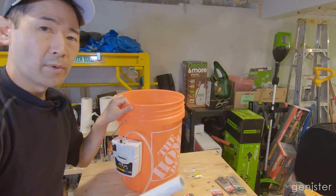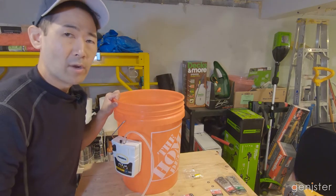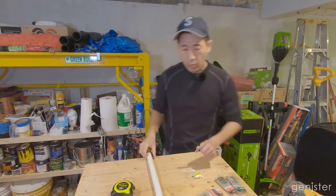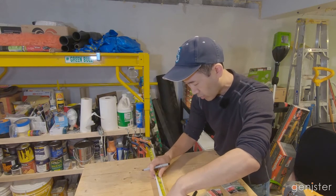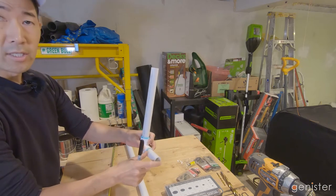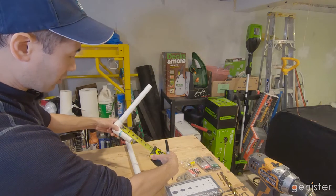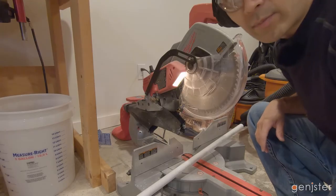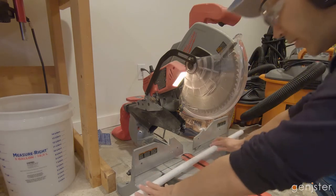I'm going to go ahead and cut this pipe. I'll use my miter saw — that's the best tool because it gives a really nice clean cut. If you don't have a miter saw, a hacksaw with a blade that can cut PVC will work well. I have three-quarter inch PVC pipe here, so I'll mark it off at 11 and three-quarter inches. For the extension from the bottom of the elbow, I want it to go out a few inches to hit the center of the bucket — probably around three to three and a quarter inches. I'll go ahead and mark that off as well. Make sure you're wearing both hearing protection and eye protection before making the cuts.